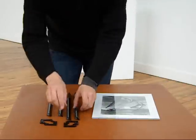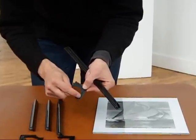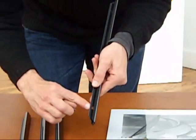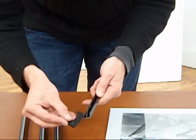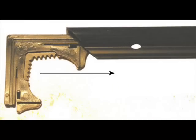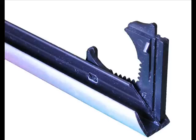We now proceed to install the corner clips into the moldings. It's important to notice that the corner clips have little raised nibs on one side — those nibs have to engage in the oval cutouts. The corner clips slide into the back channel; the nibs protrude and must go into the oval cutout when pushed into place, which locks them. The front channel remains free for the image assembly.